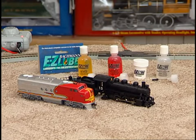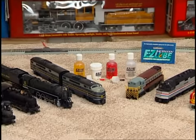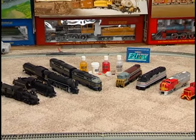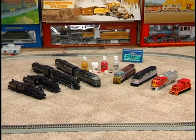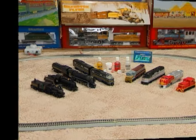The steps we take can be generalized to many different locomotives, with the basics being to apply a small amount of lubrication to all motor bearings, axle bearings, and the additional bearing surfaces, and in the case of steam locomotives, to all exterior operating valve gear.